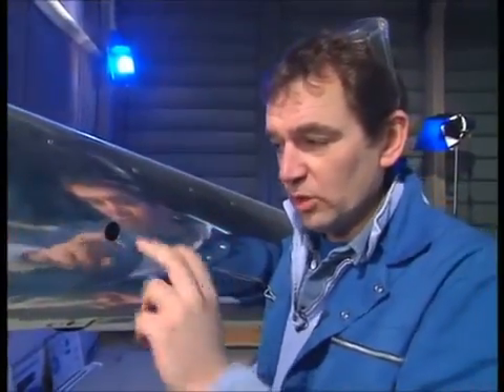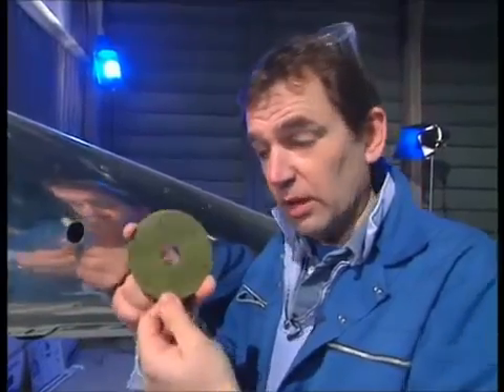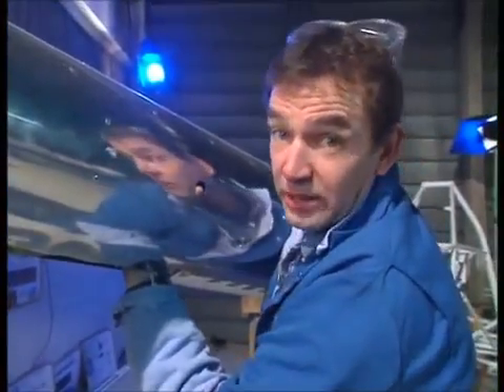The trim fin bolts into the aluminium of the tail boom with just two bolts. Now this is not very thick aluminium, so what I've got to put in is a doubler. The doubler will actually fit up in here on the inside of that hole and we'll then have some nut plates on it.